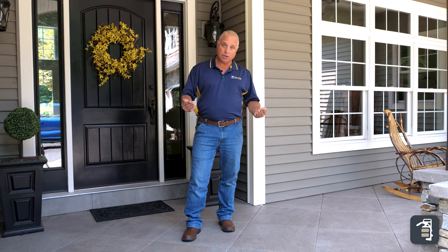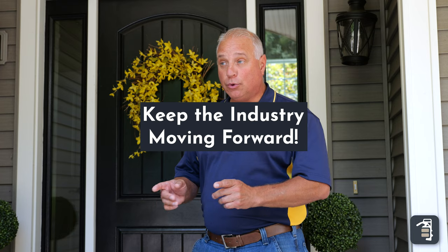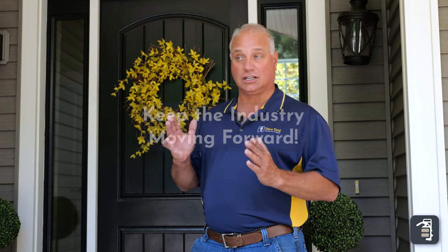The greatest takeaway from this video: as a contractor, to offer a professional installation practice we have to stop installing products in a way that results in a call two or three years later. Customers will say they don't trust that contractor and call somebody else — and that's what we need to get away from in this industry. Porcelain products are seeing lots of failures because the joint can't be maintained on an open grade system; it needs to be wet-set. Let's keep the industry moving forward in a professional way, giving our customers a product that's going to last them forever.